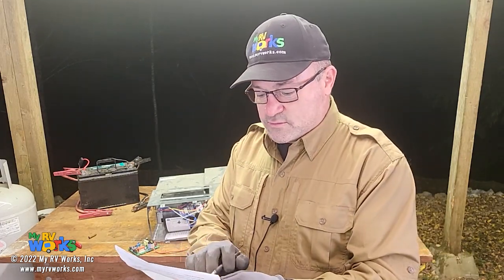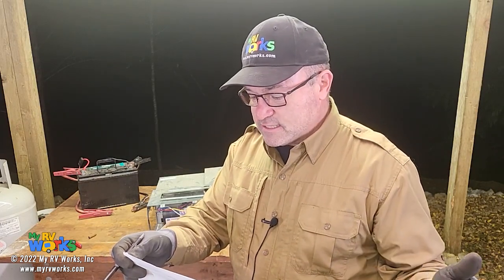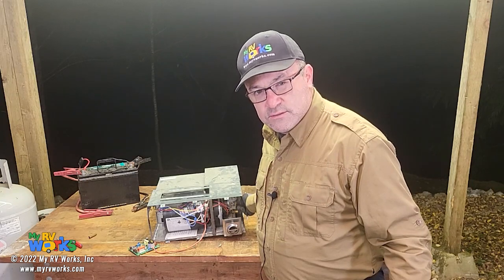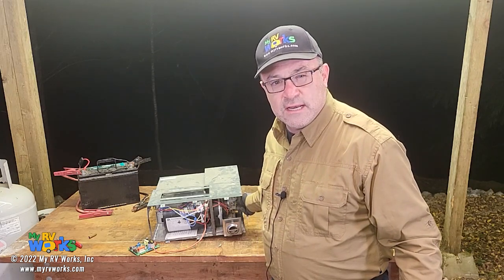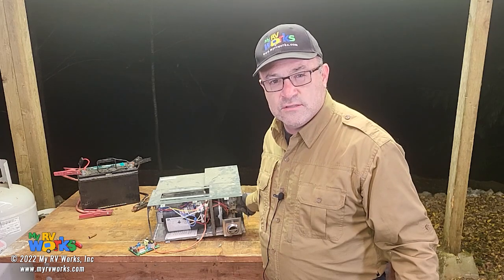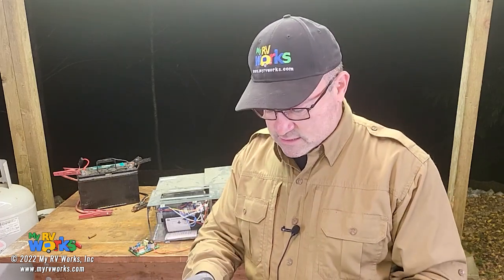So on his first sentence: the fan blows, he can smell gas, but he's not hearing clicking. The clicking sound is going to be the gas solenoids engaging. It's interesting that you're not hearing the clicking but you're smelling the gas. What I'm thinking you mean in your statement - even though you say you're not hearing clicking - is that you're not hearing the ticking sound, which is a tick tick tick tick tick. So let's keep going.